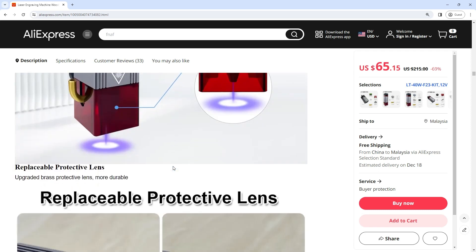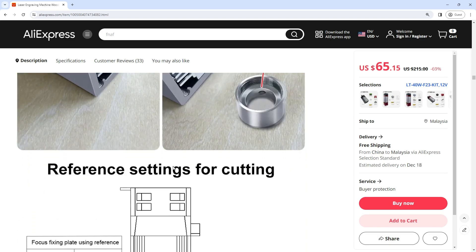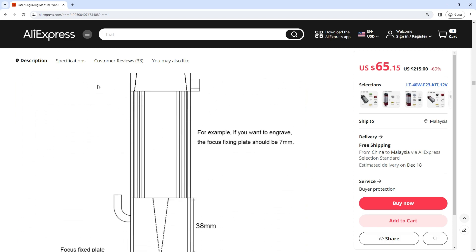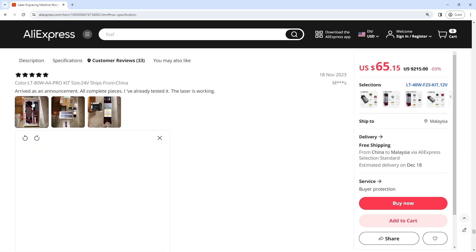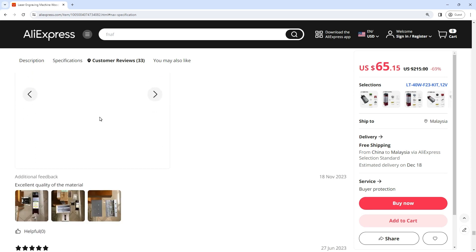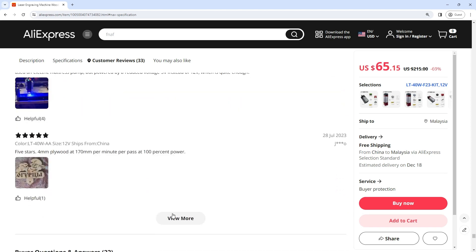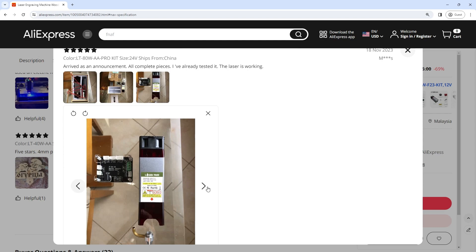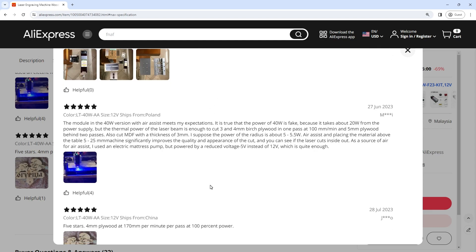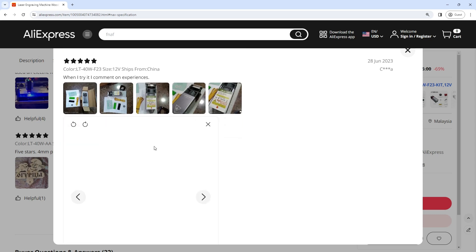Professional air assist: upgraded 6mm diameter nozzle has an advanced hydrodynamic design which better reduces air resistance and delivers faster jet airflow. Recommended air tube: 4mm inner diameter, 6mm outer diameter. Air pump suggestion: air pressure and capacity 0 to 27 kPa, 27 liters per minute.